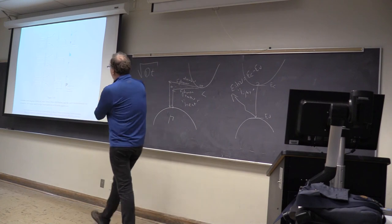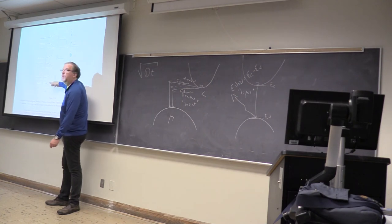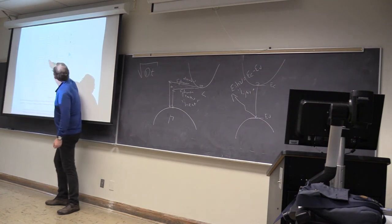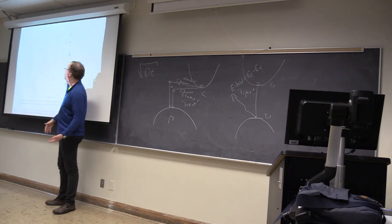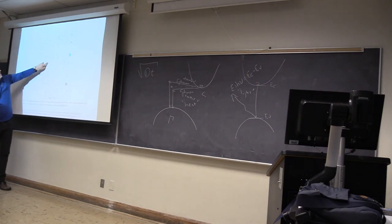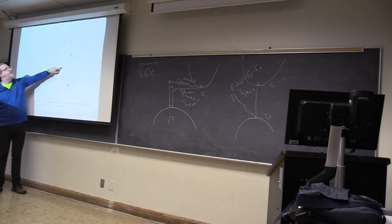And then this is what I really care about, right? These are a means to an end. This is telling me where the Fermi-Dirac goes up and down based on the carrier statistics. The density of states actually doesn't change. If you notice, this is the same semiconductor, I haven't changed the semiconductor. These two are the same as this and this. The only thing that's shifting is the Fermi-Dirac, because that depends upon the doping.